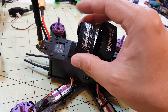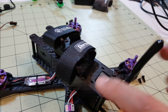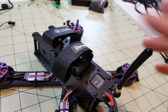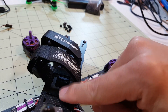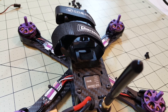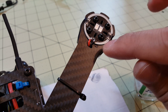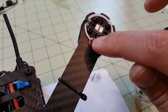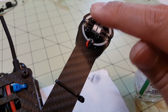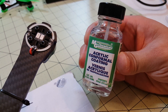I added an extra battery strap in the slot behind the first one, and added these little grip pads — or sticky pads — to grip the battery. As long as there's pressure from the strap pulling the battery down, it should stay in. I got one over here and one over there. The last thing I'm doing is adding some conformal coating to the exposed leads going to the LED, and to some of the resistors here, just to make sure it doesn't short by accident.